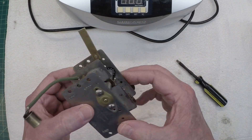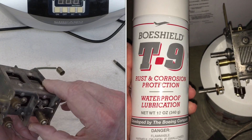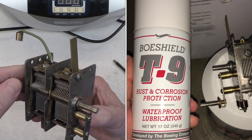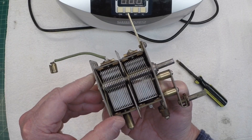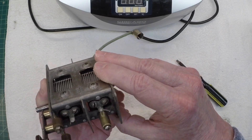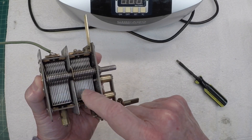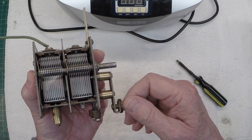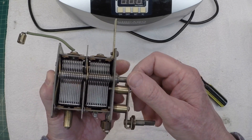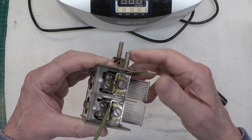I've still got to put a rust inhibitor on it, and everything's nice and dry. What I want to do next is check and make sure we don't have any shorts between the stator and rotor. Let me get the digital multimeter. We'll check both sections — the rear and the front. If I recall correctly, the rear section had a short, and I didn't take any time to mitigate that before cleaning the tuning condenser.